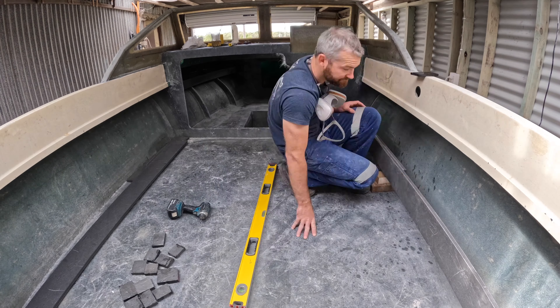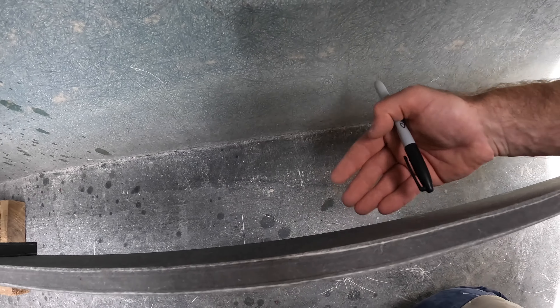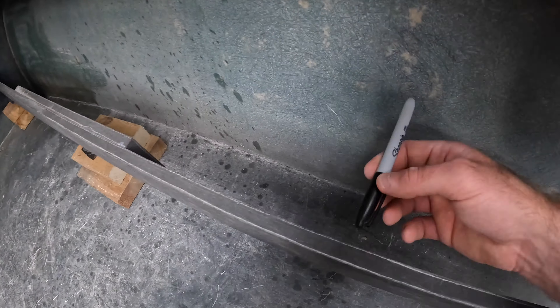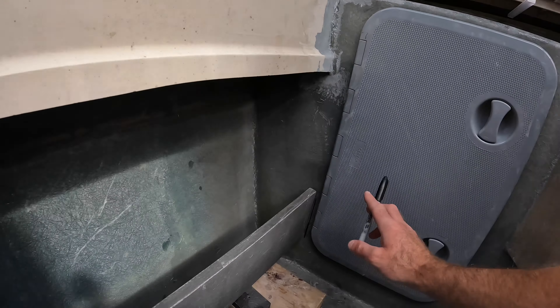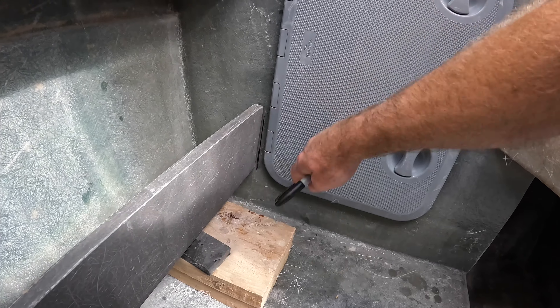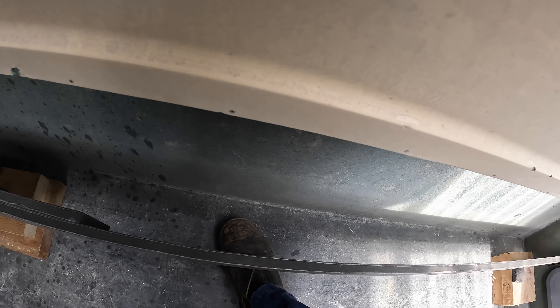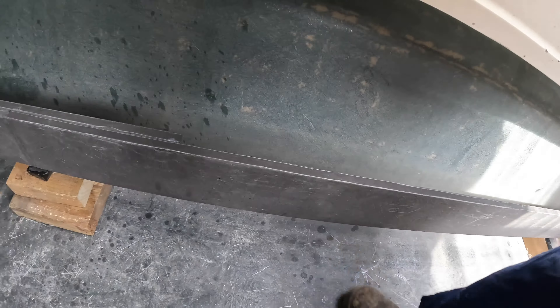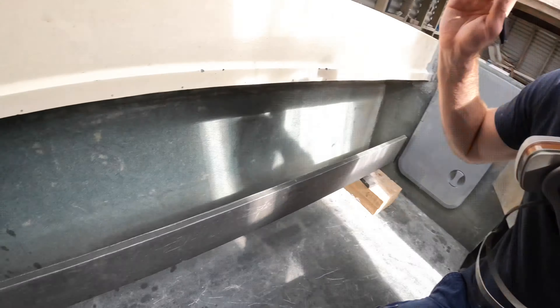So what I've done is cut out my material. I've made the thermalite section 150mm high and it won't grow any more than that because the second part of our side pocket will drop in and sit flush on the inside here and come over and meet up against there. What I've got to work out now is how far out I want the side pocket to come. I've put the hatch in because the hatch actually protrudes past the cutout, so I want to make sure I've got clearance for my hatch to open there, and also enough height underneath to get my feet under there — feet in boots, a decent height. That height is also going to make it easier to glass up under there, and we don't want to be making it too difficult by giving ourselves only a 50mm gap over that distance.